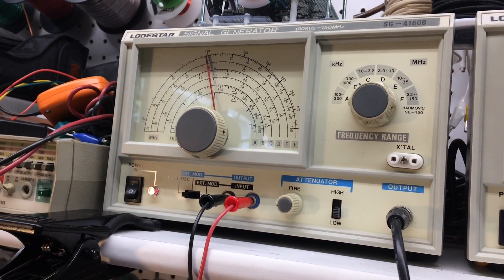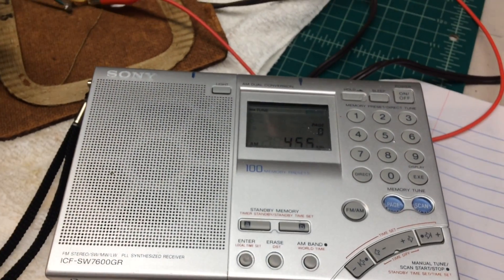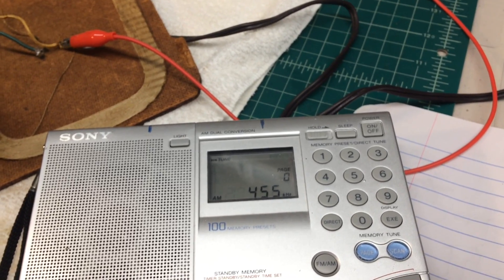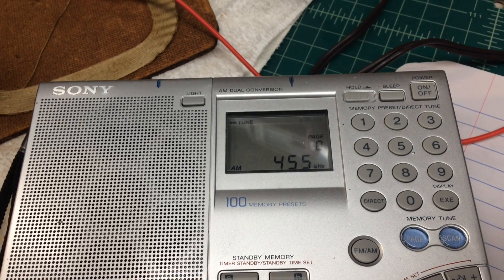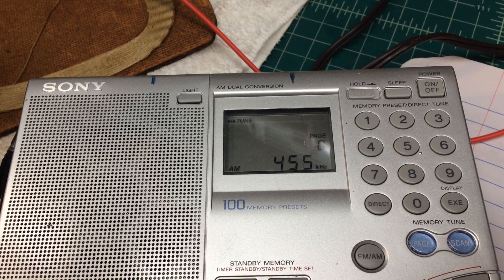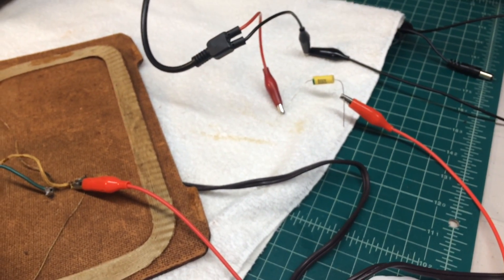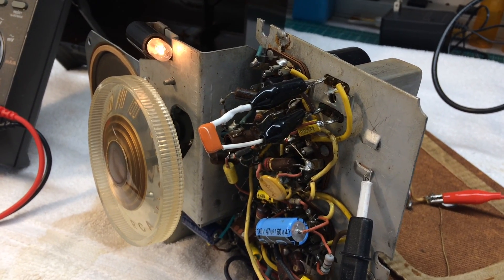You can see I've got the receiver plugged in and playing, warming up for a good while. I've got my RF signal generator set to 455 kilohertz, or very close to that. For folks that do not have access to a frequency counter, I'm going to use my receiver — you can see that's showing 455 kilohertz. I'm going to rock my signal generator back and forth and listen for a zero beat, and I'll use that as my reference frequency. You can see I've got things hooked up to the signal generator through a capacitor.